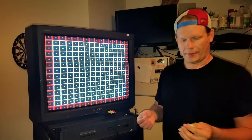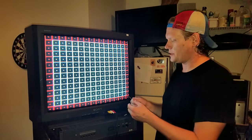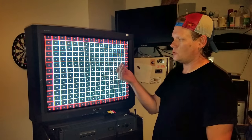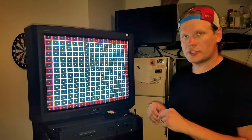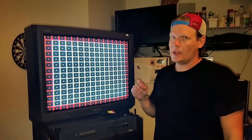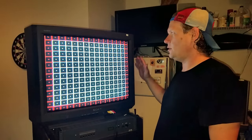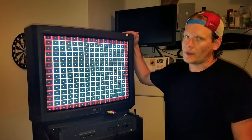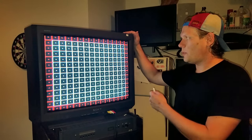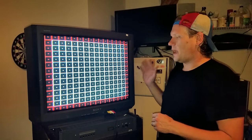For today we're just going to concentrate on those convergence strips and using that small magnet to fix one corner at a time. To recap: to fix the color wonkiness you can use corner convergence strips - we saw how those go in behind the yoke - and I also showed you how to use the small magnets, which on this one had to be set on the yoke rather than the back of the CRT. Something to realize: this is a 20-year-old tube television, so you're probably not going to get it perfect, but you can get it back to almost perfect and definitely better than it was.